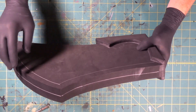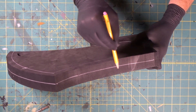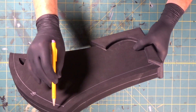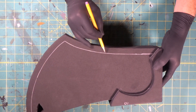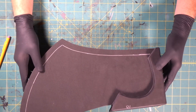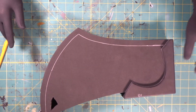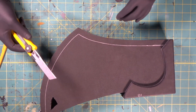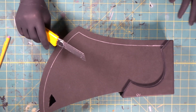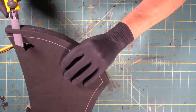Now we have our mark. We're going to be making a bevel from this center peak right there, right down the middle, up to this peak, all the way around our blade. Then we're going to flip it around and go from this line to that peak, so we've got a nice taper. We're going to start up here at the front and use our box cutter to cut a bunch of this corner off — it saves us some dremeling time.